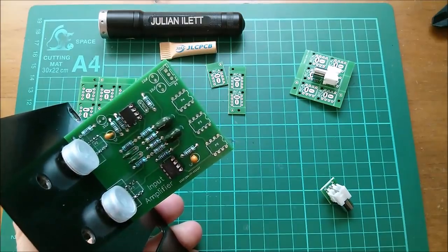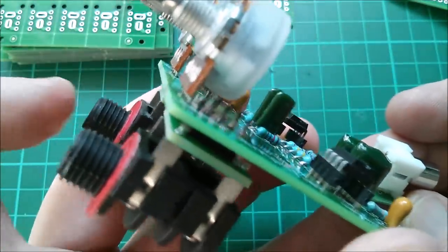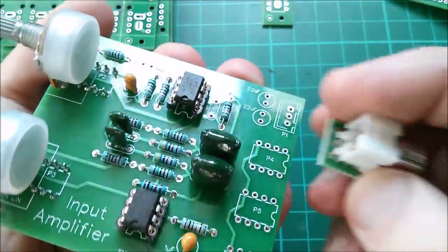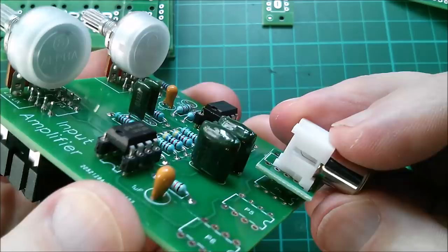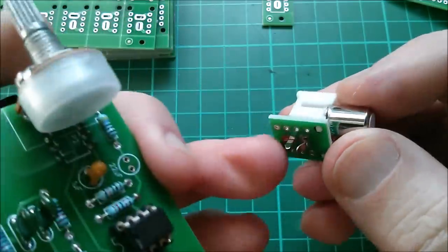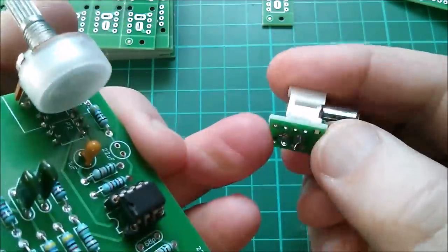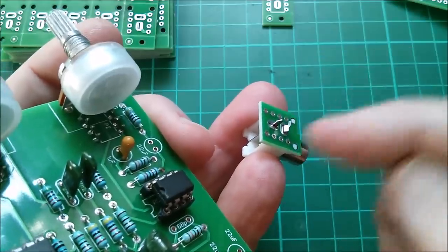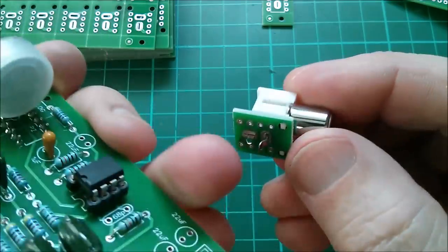Let's make up some RCA ones and put them in this board - I'll take the board off the front panel so we can see what they look like. Three of these phono sockets fit on the back of the board, which means it's got jack sockets on the front and phono sockets on the back - it's a self-contained module. You put power to it through the JST connector. Now I've just noticed these pins are really quite long, so they're going to be much taller than the plastic pieces on the Arduino DuPont pin arrays.